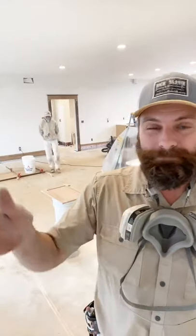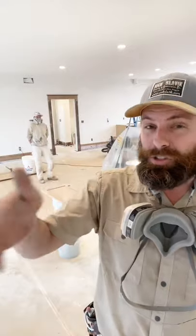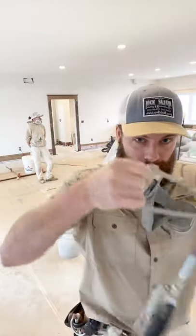Every set of cabinet doors is going to want something different. With these bare oak cabinets, because of the way they were finish sanded before I got them, they want a little bit higher with the sprayer. You can see my gun getting farther away at a slower pattern like that. When I did my normal kind of quicker multiple passes like that, it still got a little zebra stripey. So I just kind of relaxed the pattern. You see what turns out good for each cabinet door.